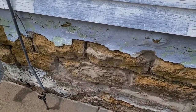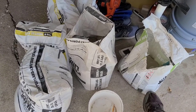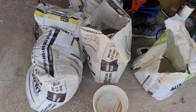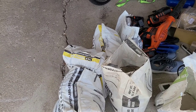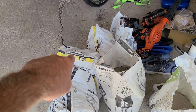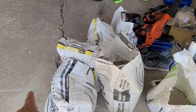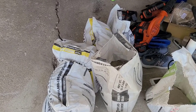I've got all kinds of stuff here. I normally use S-type mortar, but our local building supply, Menards, ran out and apparently it's going to take weeks to get more S-type mortar. So I bought some N-type mortar - I haven't used it, it's similar but a little different. What I found on the internet is I'll just add a little bit of extra portland cement to make it stronger, because N-type is a slightly weaker mix. The ratio is different - S-type is something like five parts sand, one part lime, one part portland cement; N-type is more like nine parts sand, two parts lime, one or two parts portland.